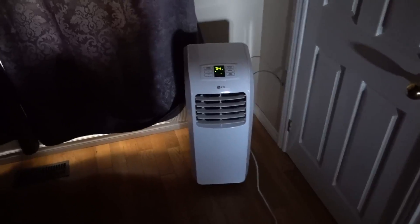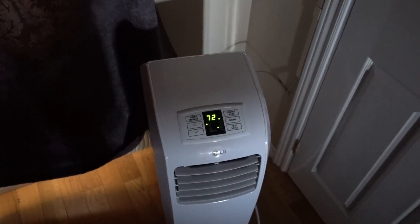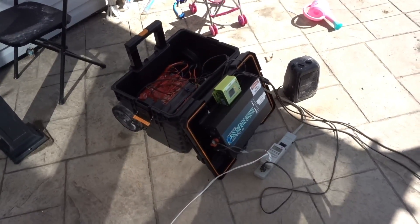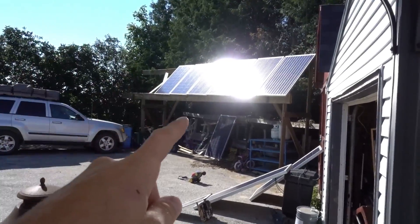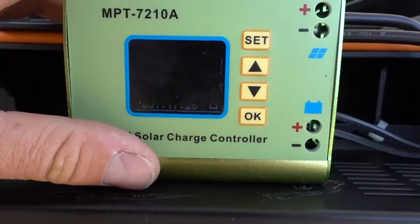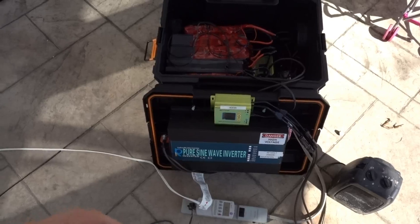Still have this running. I have it set to 72. Because the sun is actually pointing right at the house it's almost climbing in here. Got my extension cord going out and we're going to go check out how the system is doing outside. My system is almost in the sun — I have to move it soon. Still have lots of sun on the solar panels, still making lots of power. Still pulling a steady 800 plus watts. Batteries are at 56.3 volts — so the batteries are going down. We started at 59. Yeah, this has been running for two hours.